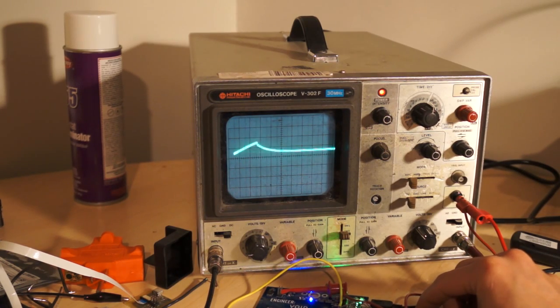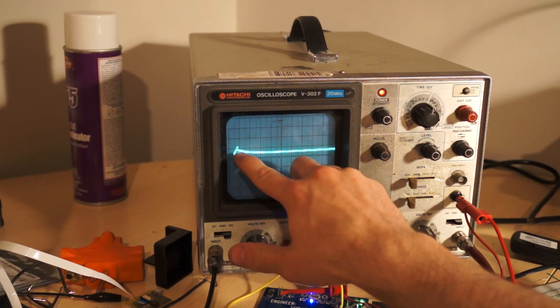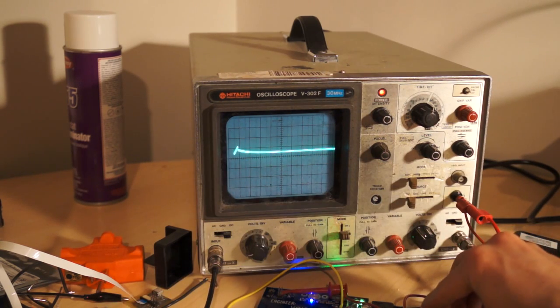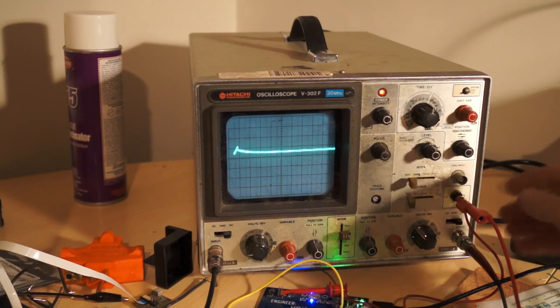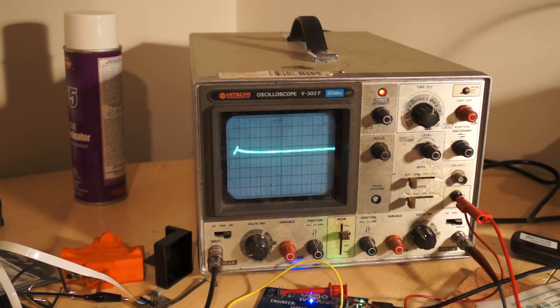And also on the scope, we can see something interesting now. Remember how I said the value was up there? Turns out it's much, much lower than I originally expected. So that's why I can press and hold and it takes longer, longer, longer until it gets up to that other value. I think there's also some AC coupling here, so we might be seeing some of that.